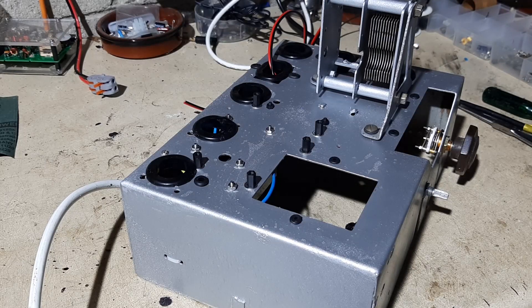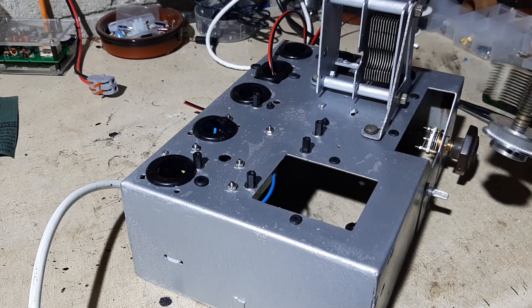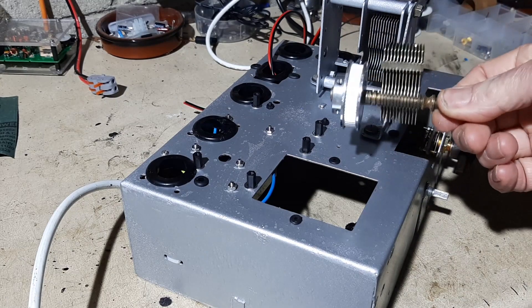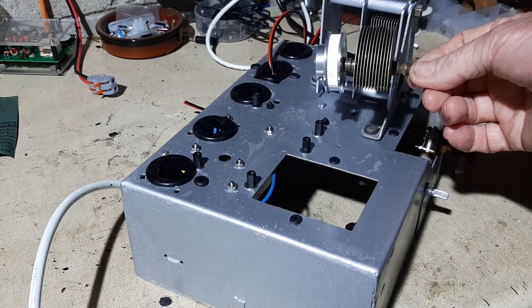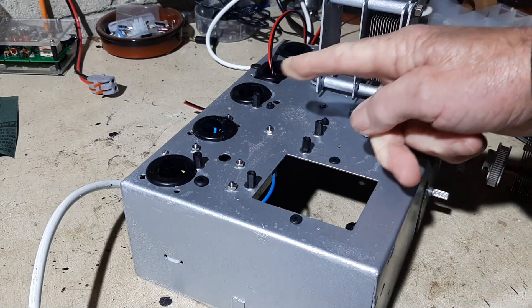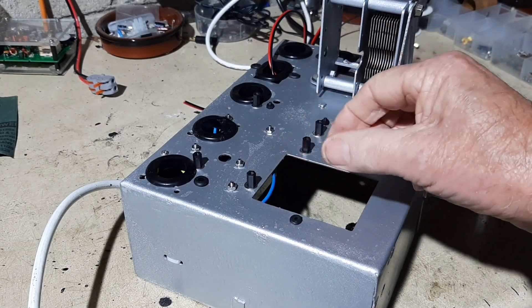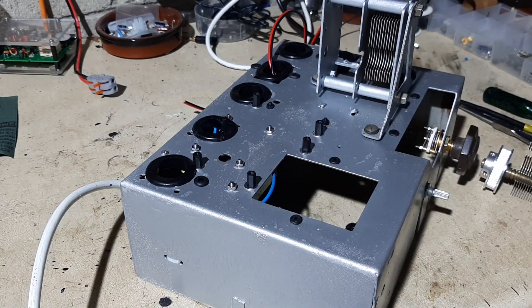On the top side of the chassis I've also stripped it down to its bare minimum. However I've left the original tuning capacitor here and taken out the rear portion of it, because what I'm going to do is fit it back in. As you can see, I have a pulley now on the back section, and this pulley is going to drive a belt over here to operate the potentiometer, which in turn will select the channels on the new radio module.